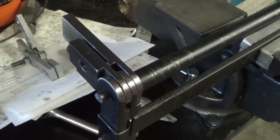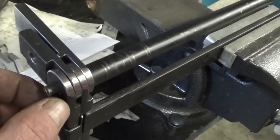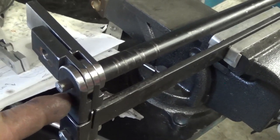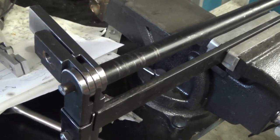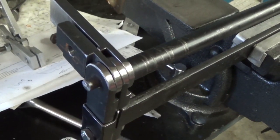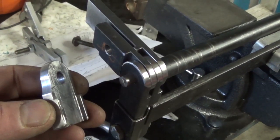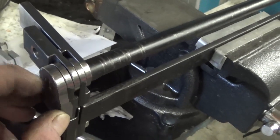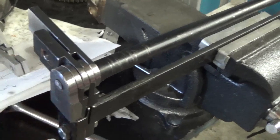So here's a little update on the console hinges. We got our pieces pretty much made. The original unit had a rod coming through here with what amounted to be a small piece of flat bar with a dimple, and relied on friction here to lock the unit. And it was always a problem with the handle not locking the tables down tightly. So what we've made up this time is a locking piece that will actually fit over our hinges, and it locks solid. So when we get this welded onto here, there should never be a problem anymore with that aspect of it.